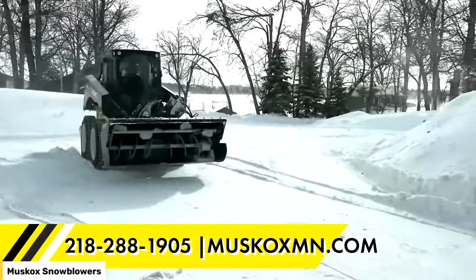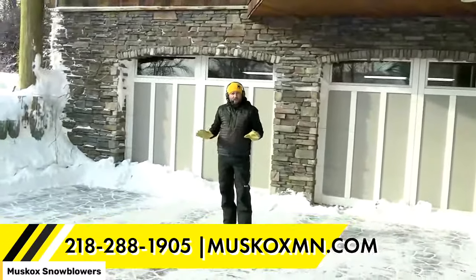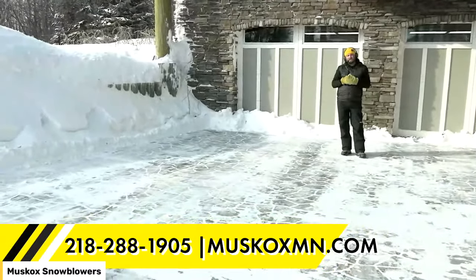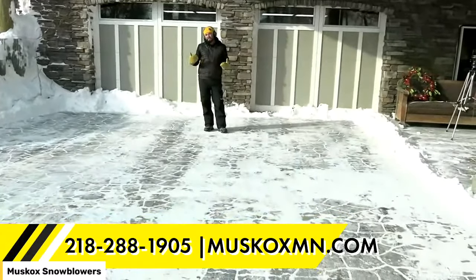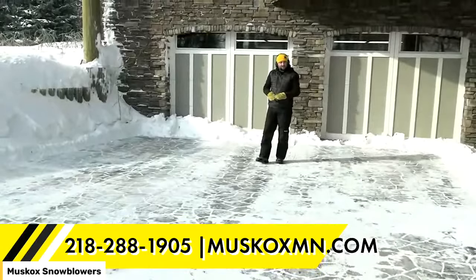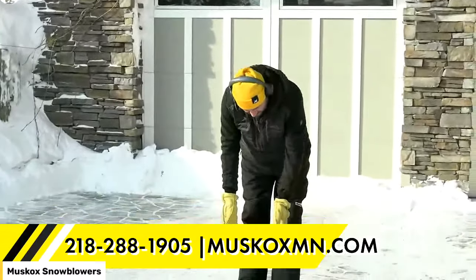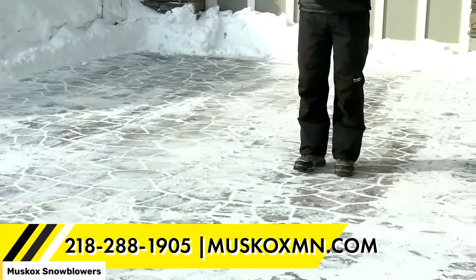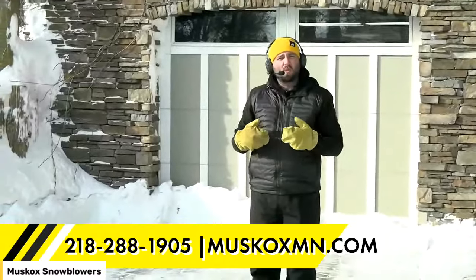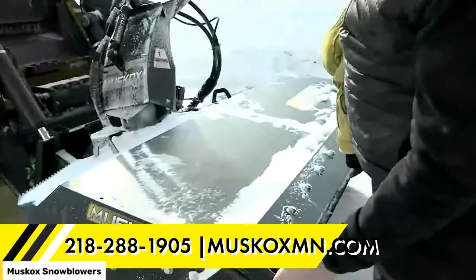Let's look at the driveway now. We've gone through the Muskox Dually and cleaned it up — traditionally we'd get a driveway like this done in about two or three minutes running at full speed. We started with a minimum of 6 inches up to about 18 inches of snow, cleaned it over stamped concrete without scratching the surface because we ride on plastic in our forward position. In our back drag position, we get aggressive on the hard surface riding on a rubber cutting edge. That rubber cutting edge: on the bottom it's steel, but on top we ride on the rubber. A very common question is how often you'll go through that rubber — this one has 140-150 hours on it and we haven't even rotated it yet.